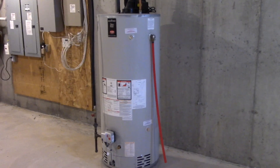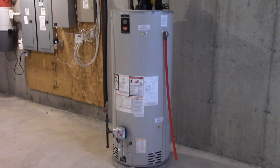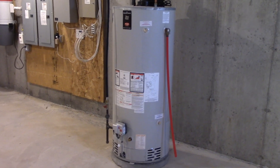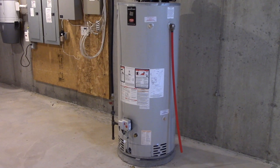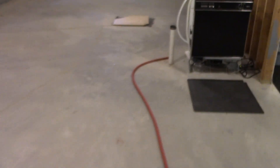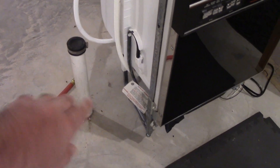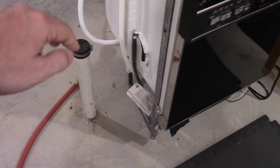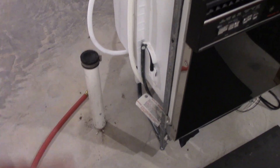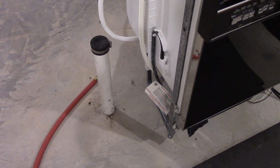If your water heater is located in your garage, that's probably the best case scenario — you can just run the hose to drain out onto the driveway. If you're in a basement like I am, it's probably going to be a little bit more difficult, but I can show you the steps I'm going to take. So one thing we're going to do is connect the drain hose to the drain port right there, and it's going to run all along here to this standpipe on the floor, which is right next to this dishwasher. Now this will work to a point, but the hose has to go up and it's going against gravity, so at some point it's probably going to stop.